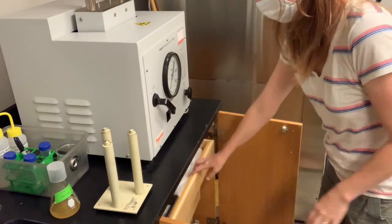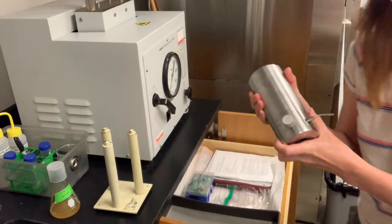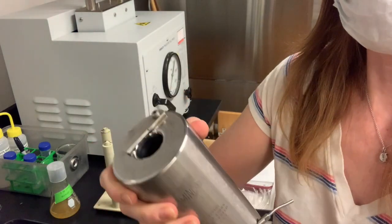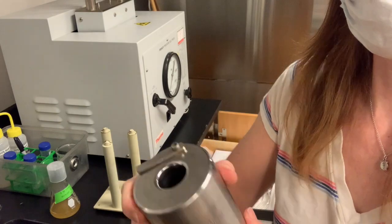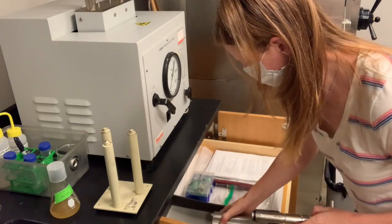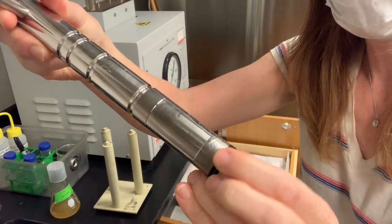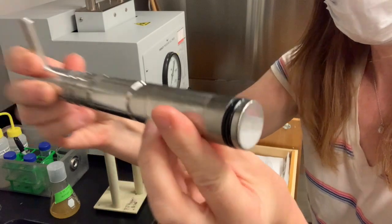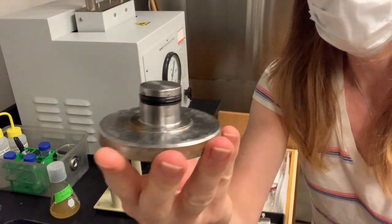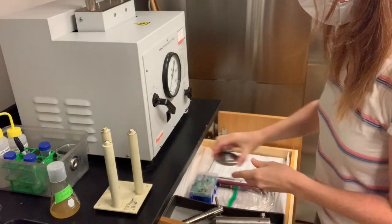Now I'll show you how to assemble all the parts of the cell and get it ready to run. In the top drawer, pull out the cell — it's pretty heavy, so get a firm grip on it, and if you're storing it in the cold room it's extra difficult to handle. On top you'll see the metal stem that locks the plunger in place, and the valve stem and outlet tube are on the bottom. The piston or plunger has a rubber O-ring at the bottom — inspect it and make sure it has no cracks and has a smooth film of silicone grease on it. The bottom closure plug should also have a non-cracked, smooth, lubricated O-ring.